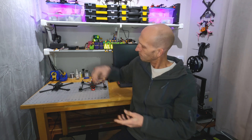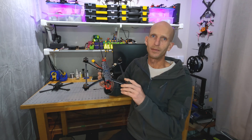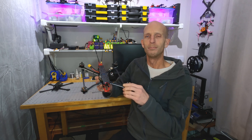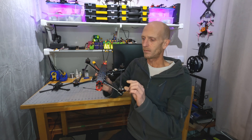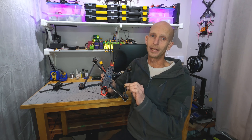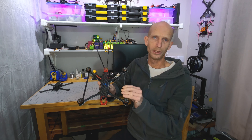At the end of that flight video, I wanted to make some improvements to the frame and to the build and try to get the weight down some more. So this is the new frame. It's 135 grams with the braces — only 10 grams lighter than the other frame, but it actually has thicker arms. The arms are six millimeters and the braces are slightly thinner but wider, so the overall cross section has more carbon to it.